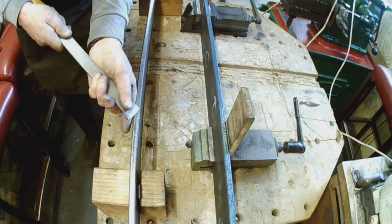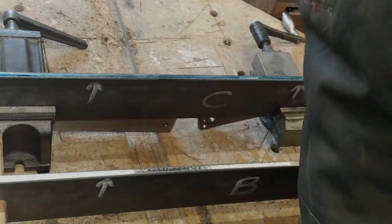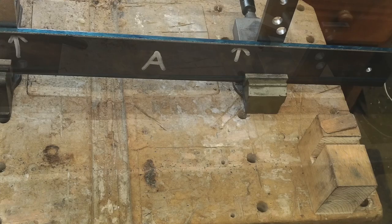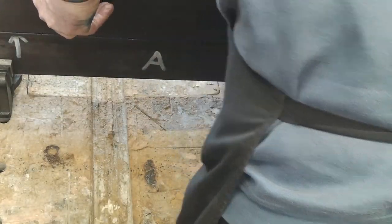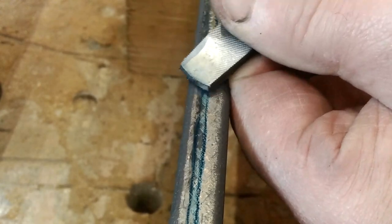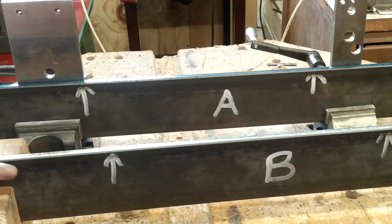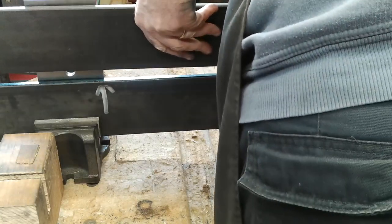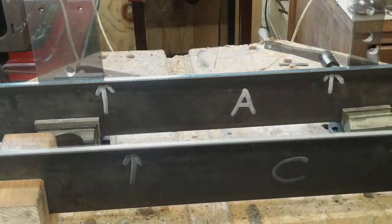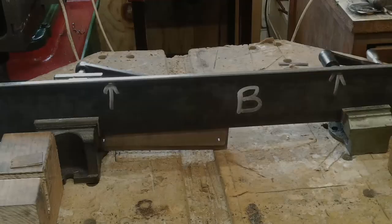There is one fly in the ointment: plate A and B are quite flat when laid down, but plate C has a very slight curve towards one end. Coupled with that, none of the plates are flat along the 100 millimetre face either. But remember, I'm not making parallels and I'm not making a flat surface — I'm making a straight edge. Another thing to contend with is the table's a bit wobbly, but I'll change this for a more sturdy one later. The primary plate is always the one in the vices on the back row in this case.